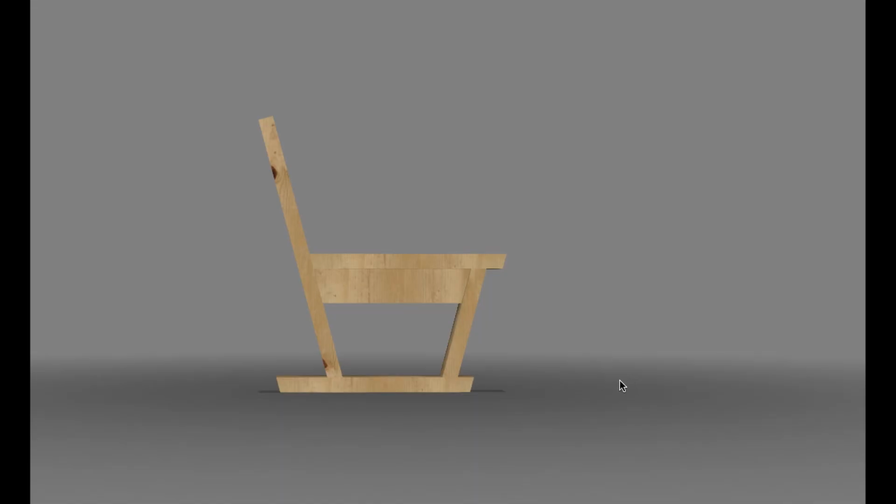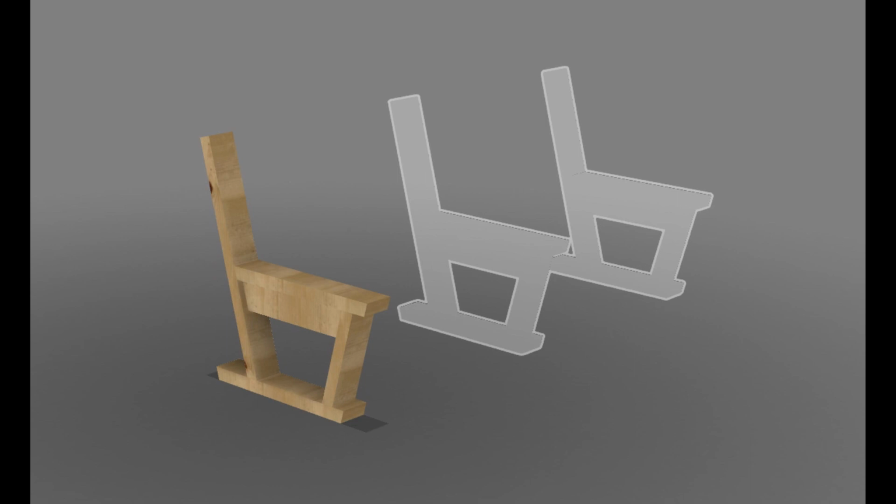Alright, so I wanted to design a bench that was easy to build but also easy to customize. So starting with a frame section built from one 2x4, using repeating parts like the top and the bottom section, but also common angles to cut out all the pieces. With the repeating parts, it's easy to scale up production of the sub-assemblies. So with one 2x4 you can get one frame, add two more 2x4s and you get more frames.